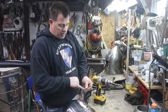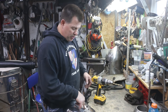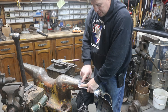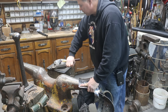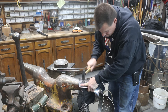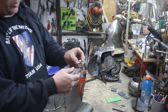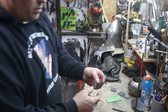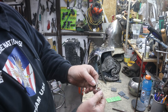When we attach these D-rings to the inside of the helmet, I want to peen the outside and we're going to do a blind rivet so it's going to be flush with the helmet — you're not going to see it when we're done. We need to countersink the holes I just drilled to give it some purchase when it's flush. The D-ring is now in there facing the direction I want. The rivet's sticking out too much, so I'm going to clip this off — putting the nippers flush with the helmet, which leaves a little bit of material up, and we're just going to pound this until flat. These D-rings I just get from Tandy Leather — nice and convenient, nickel plated, so it's not going to rust or have any problems.